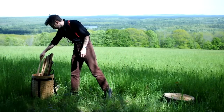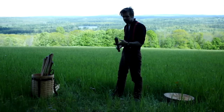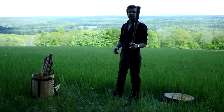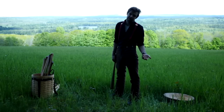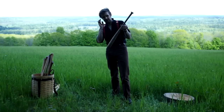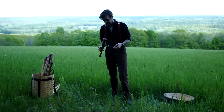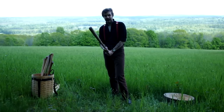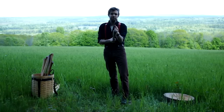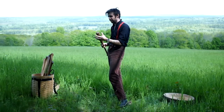Let's start by talking about a baseball bat. A baseball bat is a tool you use to hit a ball, and the nice thing about it is it's got perfect symmetry — the balance is right where you intuitively think it's going to be. This is a little t-ball bat, but it still shows the purpose. Double bit axes are symmetrical in this same way. A baseball bat is a really good example of how we wish an axe could act — when you swing it, you know exactly where it is because it's just straight to your body. We wish axes could be like this, but they can't because we need to affix a tool to the end of them.